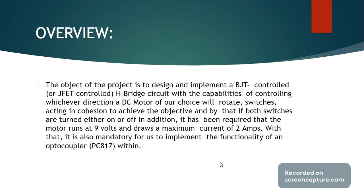This is because when zero inputs are applied, meaning the buttons aren't allowing current to pass through, then there is no current available to be supplied to the DC motor acting as our load. Whereas if both buttons allow current, then the currents go to the same center where the motor lies and cancel each other out because they are of equal magnitude, but they are traversing in opposite directions.